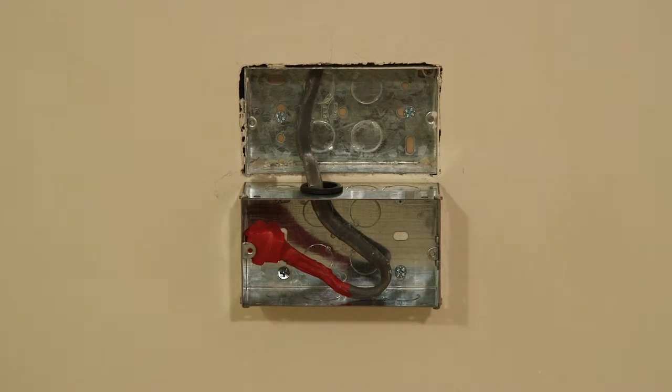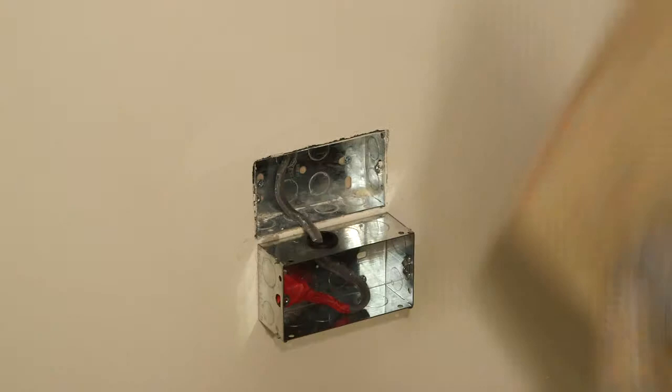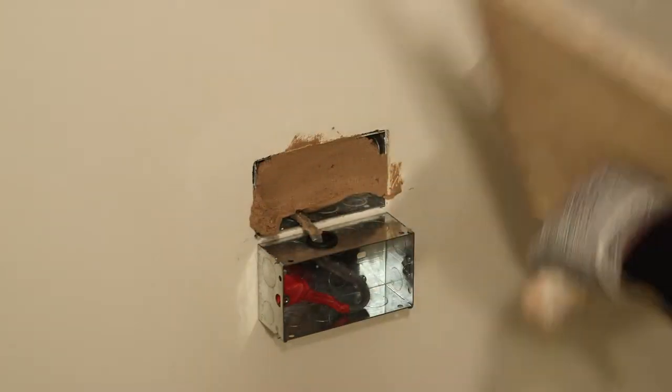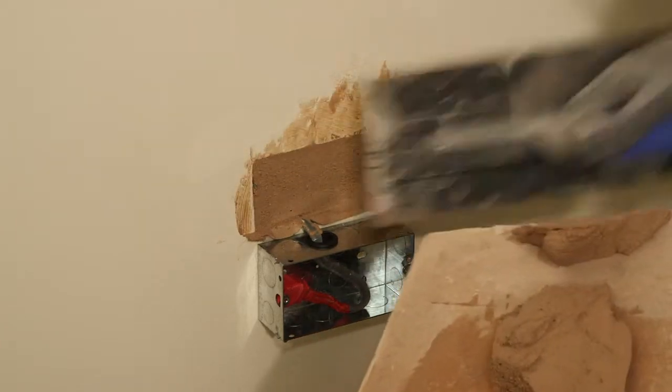Electrical sockets are repositioned with a metal back box being fixed to the plaster surface. Old socket positions can be filled with Thistle undercoat plaster to provide optimum sound insulation to the lining system.